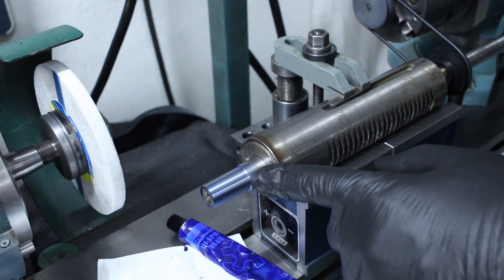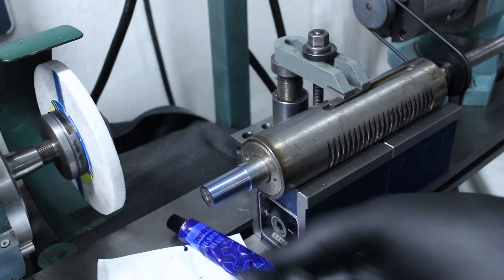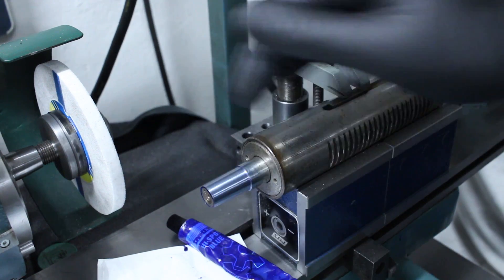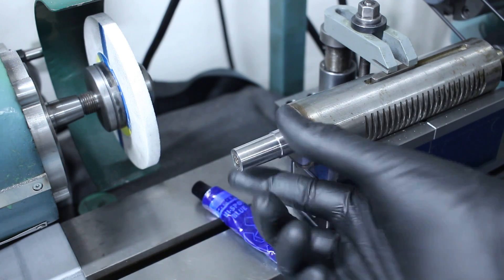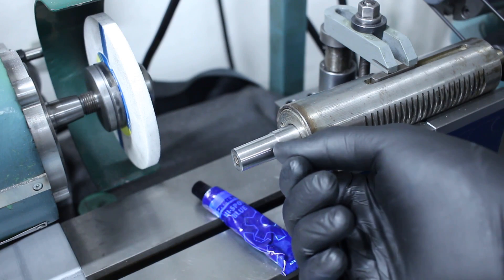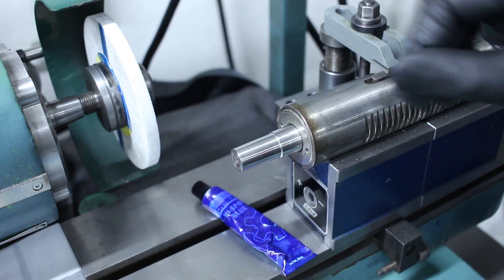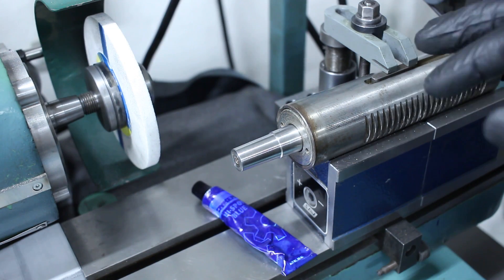There's a nice lead-out radius to the old diameter of the shaft, which is very good — no stress riser there, so the taper won't break as easily as with a sharp corner or an undercut. We're good to go — that's another one done. We're done regrinding the taper. I ran a flexible Cratex stick over it to give a nice shine without changing the geometry, which also removed the hairline burr on the edge. I rolled over the front edge with a stone while it was running until there was no sharp edge. Let's take the setup down, pack it up, send it back. Hope you enjoyed this short one — thank you all for watching, see you next time.